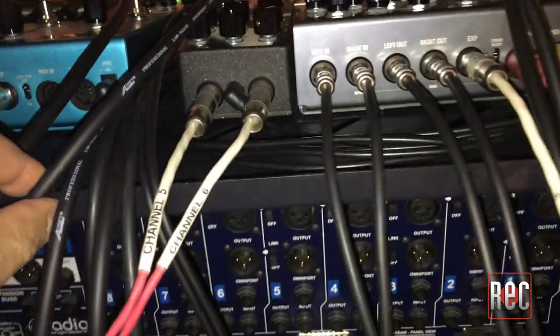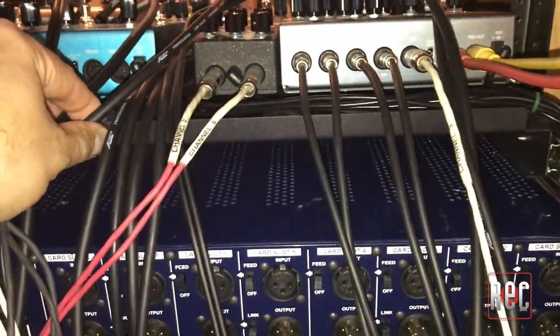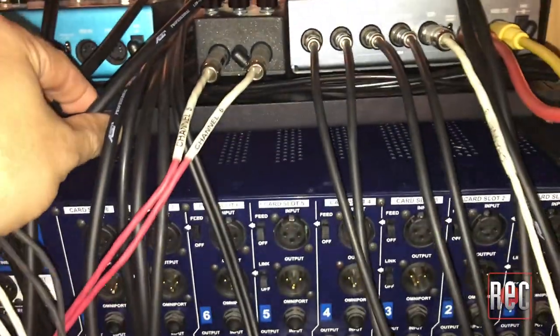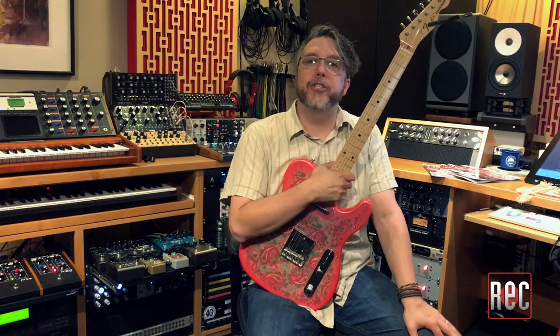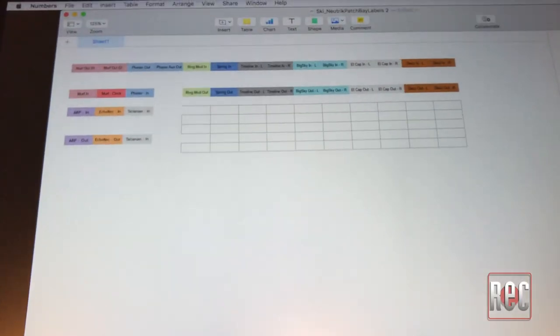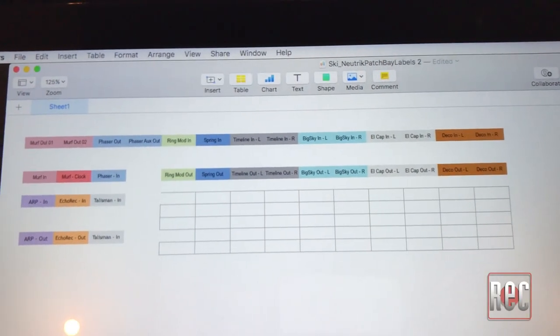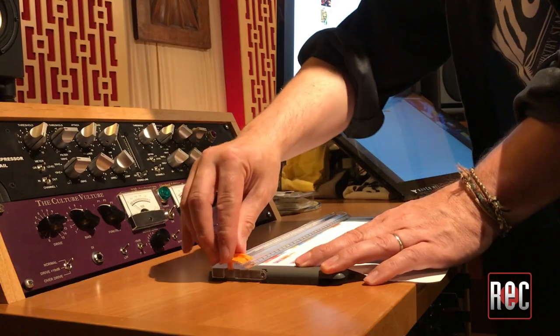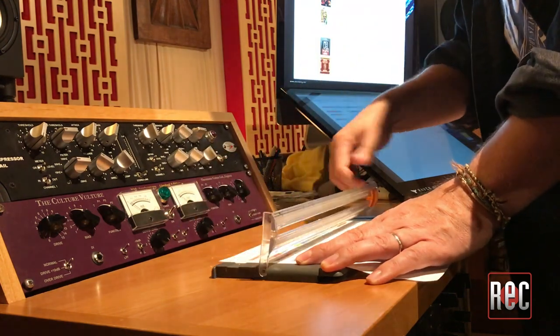Also, as you bundle and route your cables together, always check for tension and play with the shelf in and fully extended. Once your connections are made and your cables are dressed and orderly, I would suggest labeling your patch bay. After printing everything on regular paper for test purposes, I then used magnetic printer paper to print labels for the balanced patch bay, but because the faceplate of the Behringer is aluminum, I needed to also add some two-sided sticky tape.